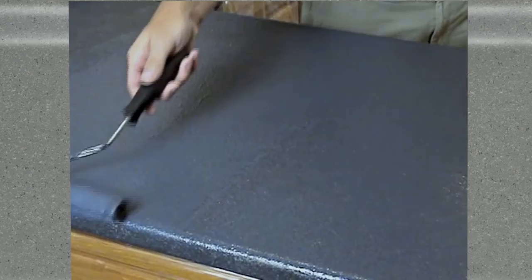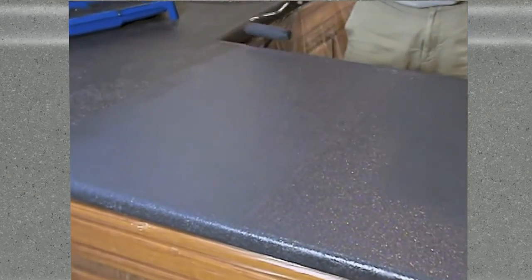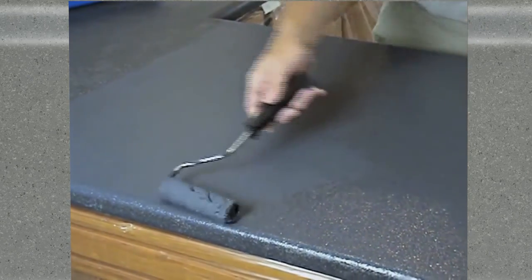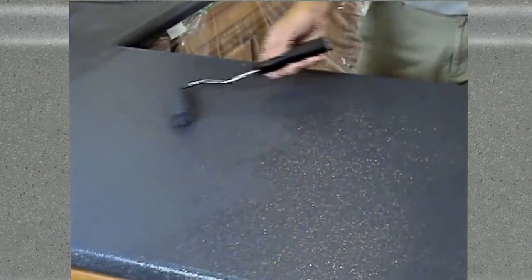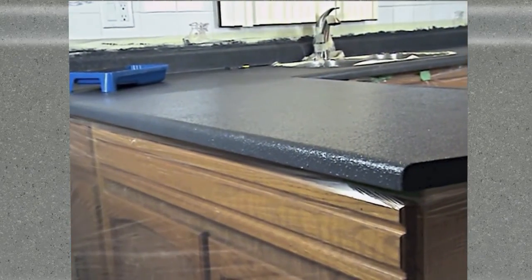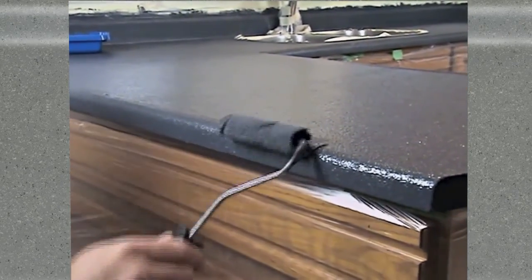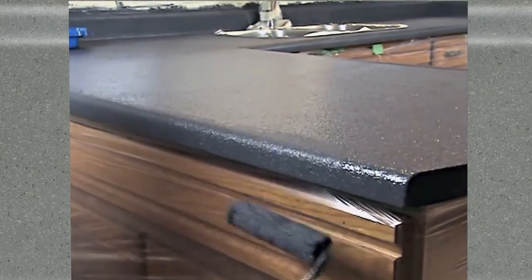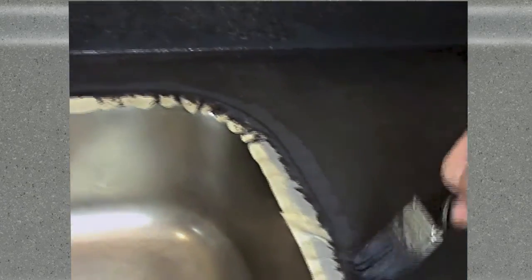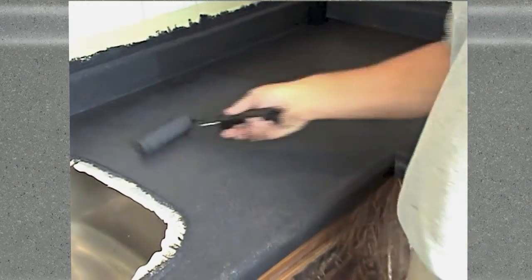After distributing the product on the surface, remember to roll over it a few times to flatten it down. Leaving it on too thick will leave excessive texture on the surface and decrease your coverage rate. The beauty of this counter and tabletop coating system is the sheer simplicity of its application — a few simple roller and brush strokes are all it takes to achieve beautiful results. Dab material into your corners and along edges, and roll out the remaining area until the surface has been uniformly covered a second time.